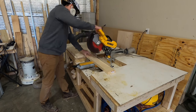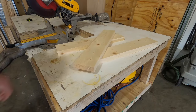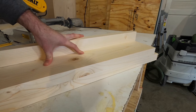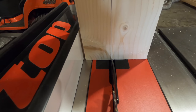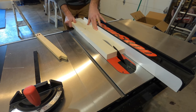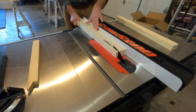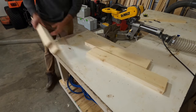I'll make three cuts to get three sections with one scrap piece — that scrap piece is important for later, so hold on to your seats. To make a perfectly square post, I line two of these boards up and make a mark on the other post. Where I made the mark, I want to leave that line when I rip it out, so I mark that with a check mark and slide the fence on the table saw to that. I rip one section off, put that piece aside, then rip the board again, giving me two identical pieces to glue up in between the two original pieces — making an absolutely perfect square.